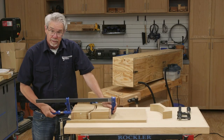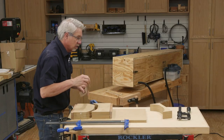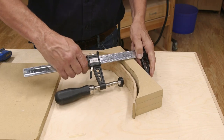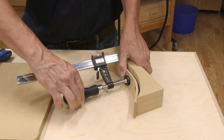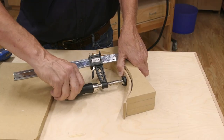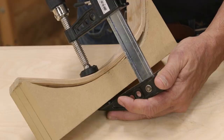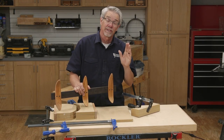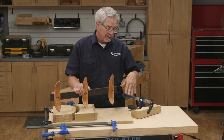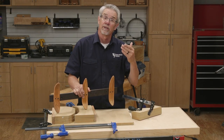After about an hour in the mold, you can take the stock out. It's not completely cured yet, so it needs to go into a cooling mold like this one. It will need to cure overnight at least, so thicker stock will need to cure longer. Now on this piece, there's a tiny fracture in one of the bends — it's not significant and it'll work out just fine. I had those on some of the other hooks; you can sand it right out. So that's it. However, there is one additional detail: steam bent wood will spring back. Its curve will relax after you're done with this whole process. So when you're making your molds, make the curves more extreme than you want in your final product.